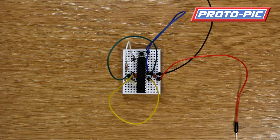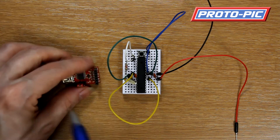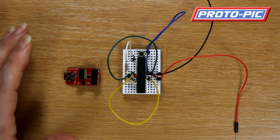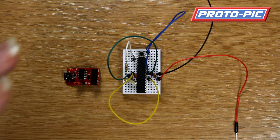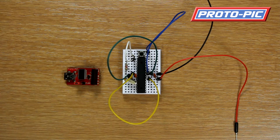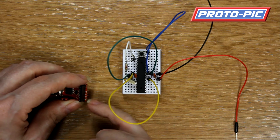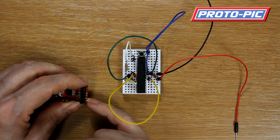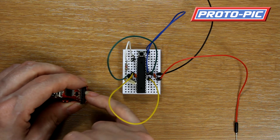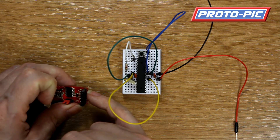Now we need to program our chip. One of the methods we cover is using an FTDI board. We will assume that you have this unplugged from your PC — it's always worthwhile not plugging these into your PC when you're plugging your jump leads in and out, because you may short-circuit something, and if there's no power on it the chances of doing damage are minimized. On the FTDI board we have various connections: reset, RX, TX, power. One pin is not used though it is connected — it's a clear-to-send pin. And then black, which is ground.